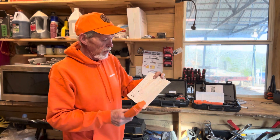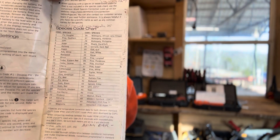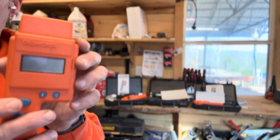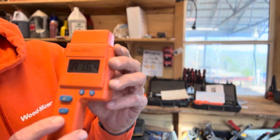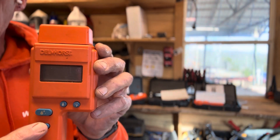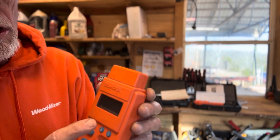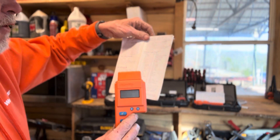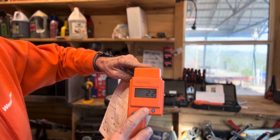The manual comes with some pretty cool stuff, including a code chart. It's got a few little buttons and I'm just going to go through them real quick. This button is for when you want to get a moisture reading, and this one is the moisture check for calibration. Right here we have the different species — it's a number one through 47. If you're doing walnut, you look down here and find that walnut is number 47, and you simply run the number up to 47.